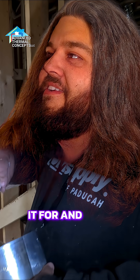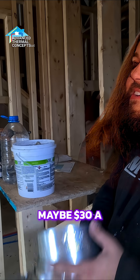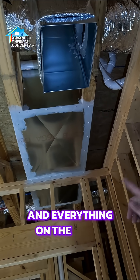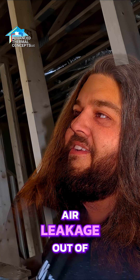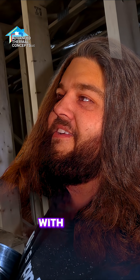It's just a preference thing, or the application we're wanting to use it for, and price point. You don't want to use three rolls of fifty dollar tape when you could use this — this is like maybe thirty dollars a bucket and it'll last through a whole job. We seal all of our ATS and ductwork on the inside, and once that's up there it'll get final mastic. All the drives — you won't have any air leakage out of any of it. Returns are all sealed from the inside and outside with mastic. It's good stuff.